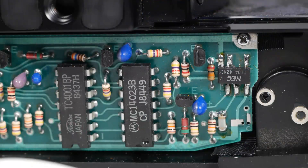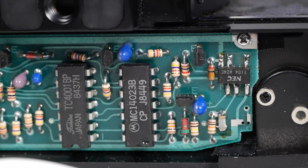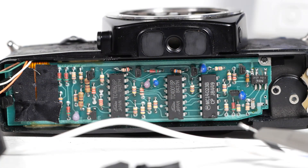As it stands I could just use the camera for long exposures, but it would be nice to understand a little bit more first. Potentially, if I'm right about the signal being the one supposed to close the second curtain, a somewhat crude adjustable shutter timer could be created by rerouting the supply for that capacitor to an array of capacitors with some dip switches to select a speed. I really should pluck out the PCB and draw out the circuit diagram, which I might still do.